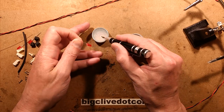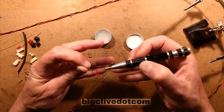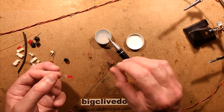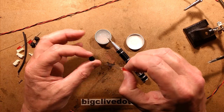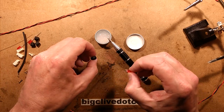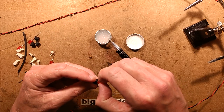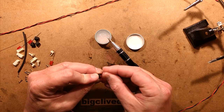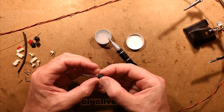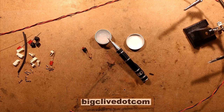I'm going to put a blob on the other side at the back of the LED and then experimentally feed it through. The grommet has two holes at the back which the leads go through. The silicone grease squished out the back and it's all over my fingers — that's okay. It looks like it's working.